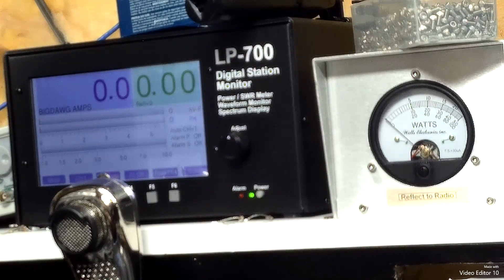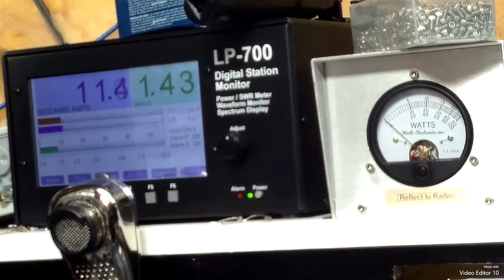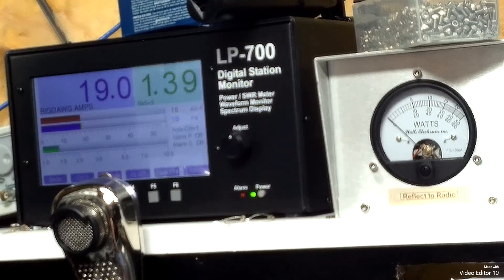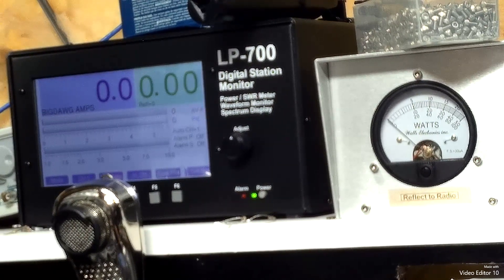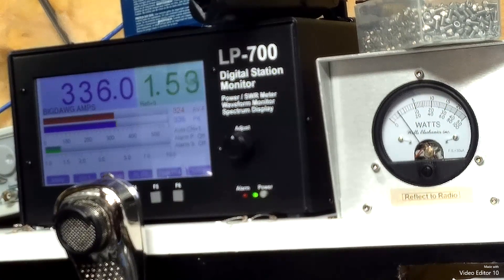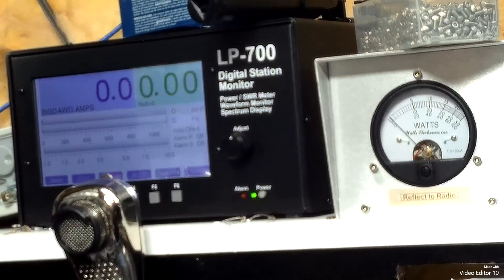With the Stryker set, let's show you what we're actually deadkeying first — bring it up a little bit. Run deadkey 17 watts from the radio, 17 watt deadkey gives us 300, 300 plus out of the amp.